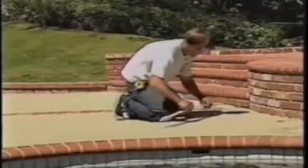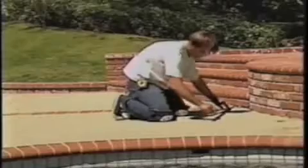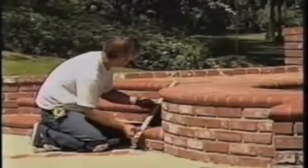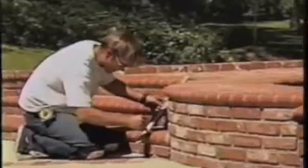If the entire template will not fit, simply mark the hole by hand, making sure to leave 1½ inches from the center of the hole to the nearest wall or step. We'll show you how to make a custom panel to fit this later. To climb the stairs, use the template to draw a straight line along the path of the fence. Next, mark the holes along the line, making sure to keep them 1½ inches from either edge. This will ensure the required 3-inch distance between panels.